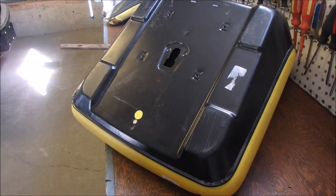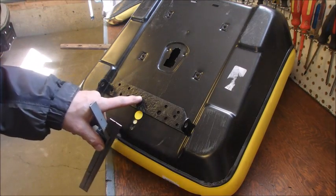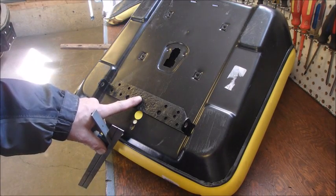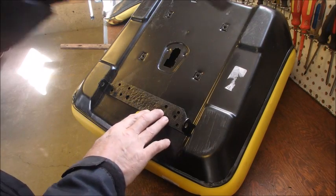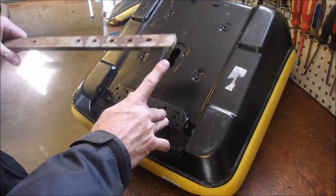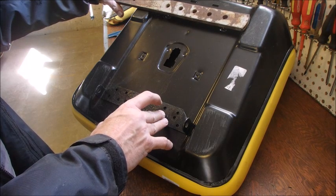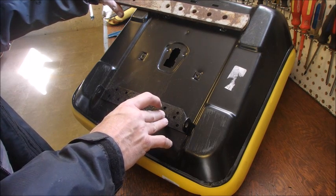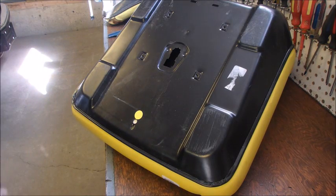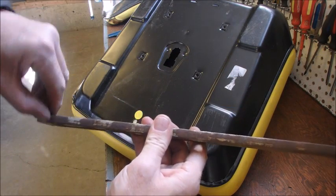Here's the bottom of the tractor seat. This bracket's going to go on here like that. I thought the springs on the base were directly behind here, but they're going to hit halfway on this perch. So what I'm going to do is take this piece of old steel, cut it off at an angle here and here — the holes will line up and I'll have a solid three-eighths-inch steel perch for the springs. I'm going to use my cut-off saw and cut it to match this angle.